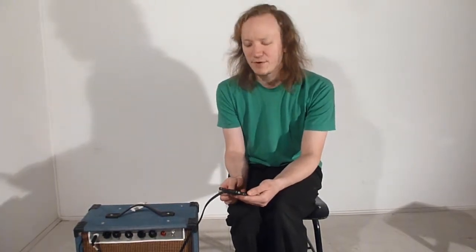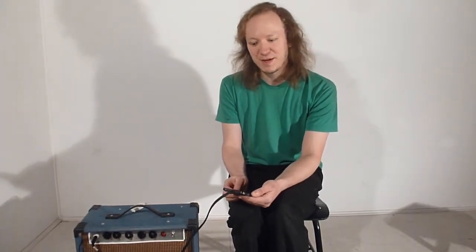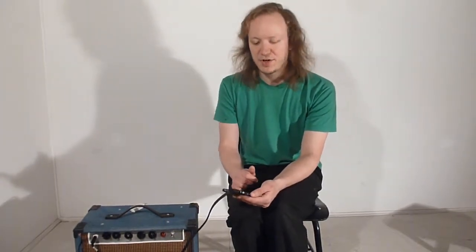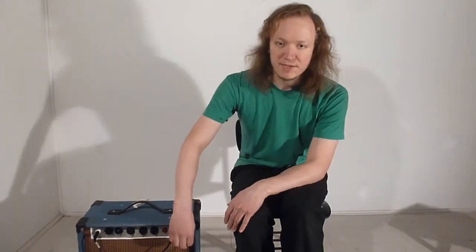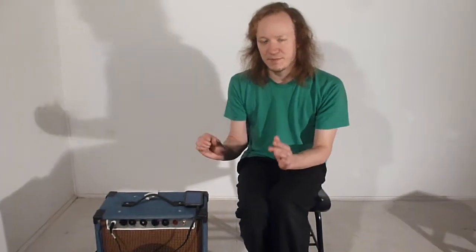I'm using 300 hertz. The reason for that is the lowest fundamental of a guitar is something like 82 or 84 hertz, but that doesn't get picked up very much, so a couple times that works well. If you have a very treble-heavy amp, you might want to pick something higher. For this amp I think 300 hertz is right — I just searched '300 hertz tone' on YouTube and found a video quickly. What you want to do is slowly bring up the volume until you can start to hear clipping.